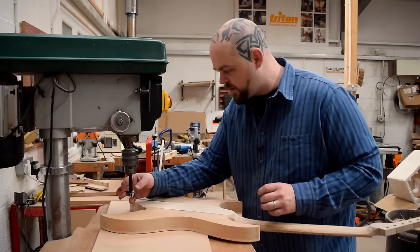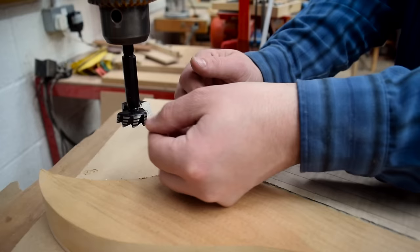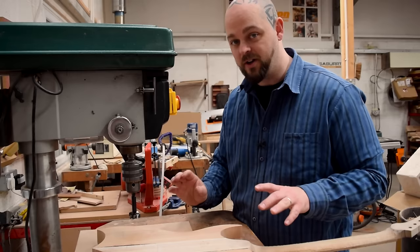I'm starting with the 35mm, it's the Bormax 2.0, patented. I think it's the Wave pieces that are patented, but it's also got that. Apparently all of this helps clear the shavings, the swarf, more quickly. Now, one of the things that they say is that these are perfect for use both in pillar drills, which is the ideal usage, or hand drills. I've never really found a Forstner bit that's good in a hand drill, and also very, very good for softwoods.